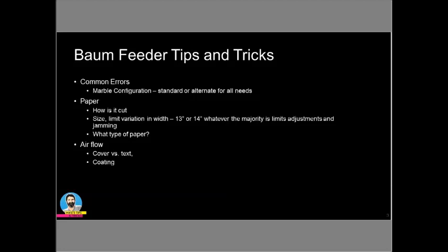The next step down the line is making sure that your sensor, your exit sensor, is clean. That will get paper dust on it. So if you remove the kind of like oven door and lift that up, there's a sensor underneath there, and you want to occasionally blow some air on it or clean that, because that will get some buildup on it, and that will also give you a lot of those kinds of errors.